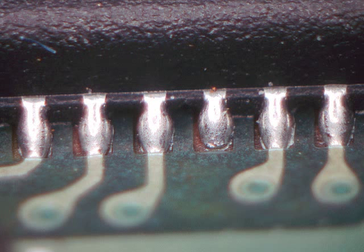So if there is bare base material on the edge of these packages, you cannot guarantee a solder joint, and there is no requirement under most inspection criteria to have this present. On some more modern QFN and LGA packages, you do actually form a solder joint in this particular area, but special precautions and special placing processes have allowed this to occur.